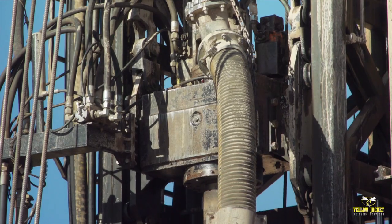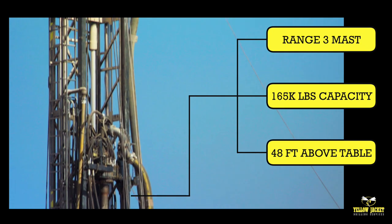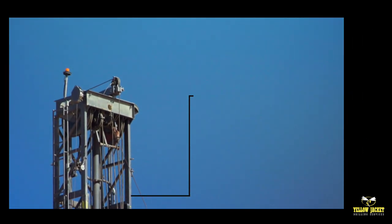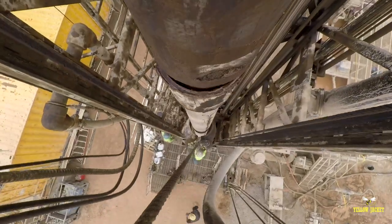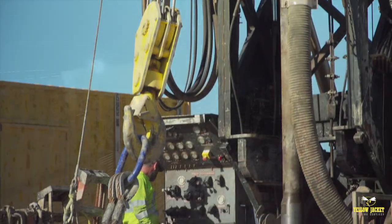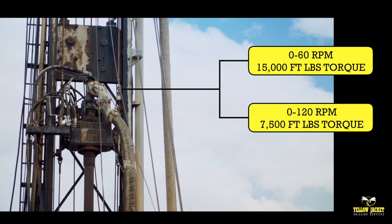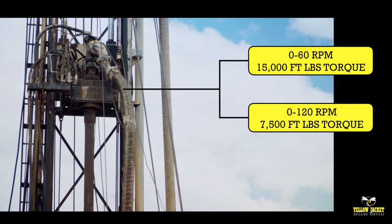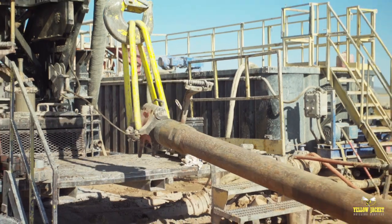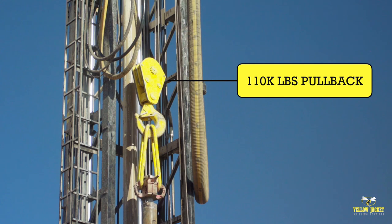Providing various deep drilling solutions, the Speedstar is equipped with a range 3 mast offering a load rating of 165,000 pounds and 48 feet of workspace above the table. This allows for 42 feet of travel while accommodating 40-foot drill sections. Utilizing a hydrostatically powered top head rotary drive with speeds ranging from 0 to 60 RPM at 15,000 foot-pounds of torque, or 0 to 120 RPM with 7,500 foot-pounds of torque, the Speedstar and its draw works with a capacity of 110,000 pounds of pullback are equipped to handle a multitude of situations.